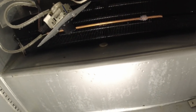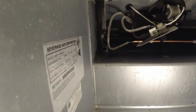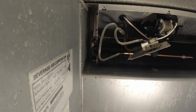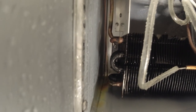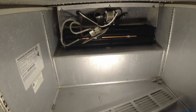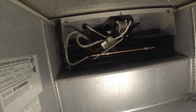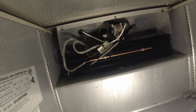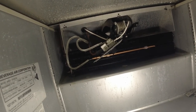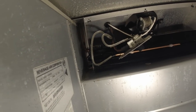Something I noticed — the drain may not be draining properly, which can cause ice issues. We finally got it melted out. On the other unit, I might not have needed to jump straight to adding refrigerant because right here on the top elbow I can see oil stains — that looks like refrigeration oil, which suggests a leak. I wouldn't have gone straight to refrigerant as the issue on that freezer if I'd looked more carefully. Generally: if a cooler freezes up and it's not the thermostat, it's a restriction or a refrigerant issue.